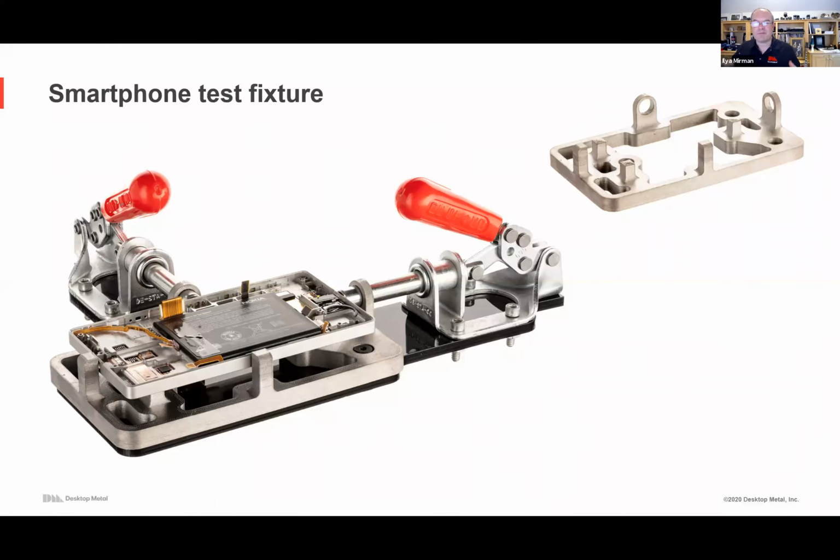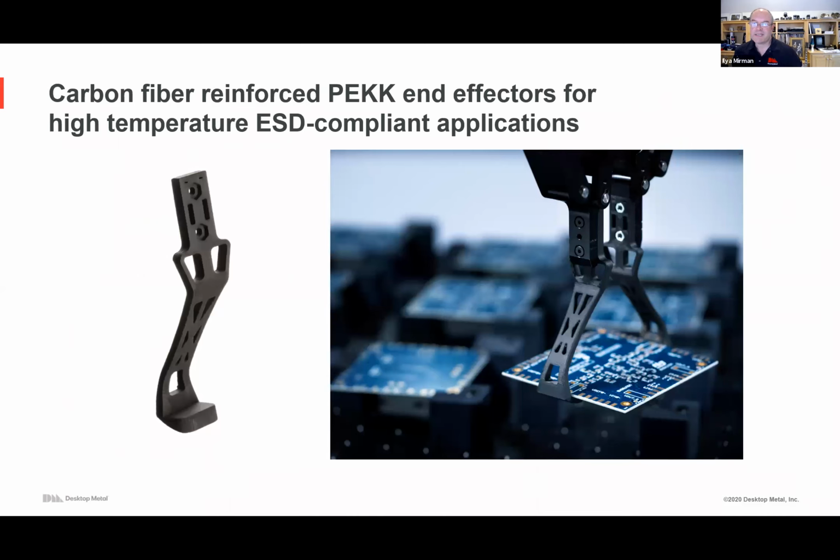Because for the manufacturing floor, you typically make relatively few of something, you can't leverage mass production techniques like casting or stamping. If you're going to make tooling, it's probably your machinist, the tool maker, that's going to create it. So being able to 3D print, with the design freedom and geometric freedom, exactly what you need in metal is a big deal.